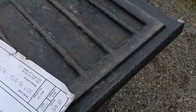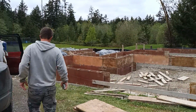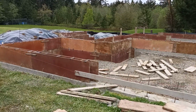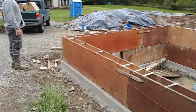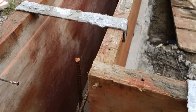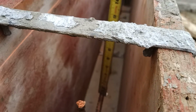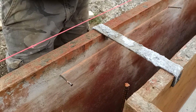Now we will head to the foundation, which has multiple steps in elevation due to dig out. Everything is formed and bucked accordingly, as you'll see. We'll head to the first wing, which is the left side wing, 14 foot or so, 2-foot wall, showing we're 12 inches from grade on the steel. Right there, well within the grade, which is shot below form.